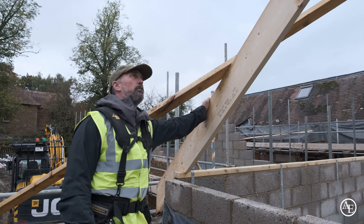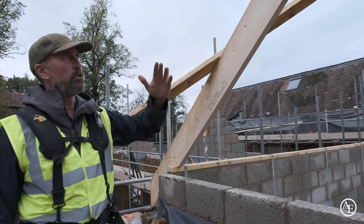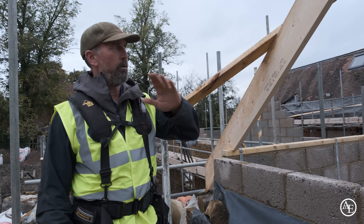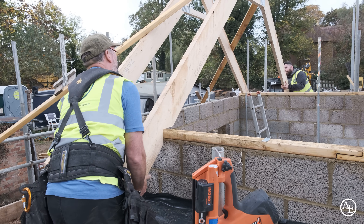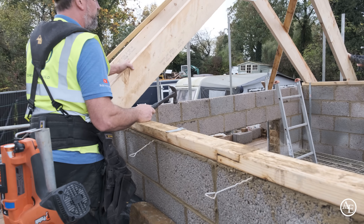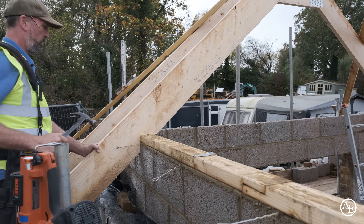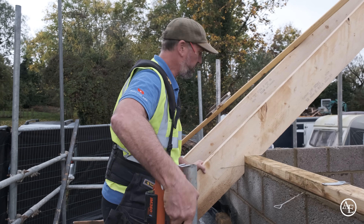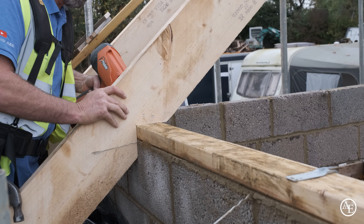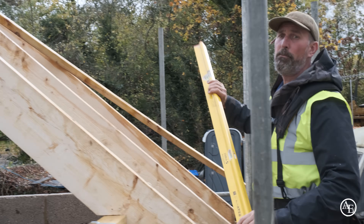What we've done is locked off this first truss really well. Me and Matt want to pull all the trusses in this way, lean them all in, and once we've leant them all in we can then work our way down here all the way up and just set them all out, get them nailed, get the truss clips in, and then start putting all the braces in. Push that down - that's lovely mate. Two in as before - just give them about half inch to three-quarters of an inch open. Spot on mate, absolutely spot on, beautiful.